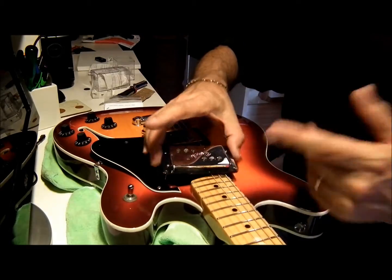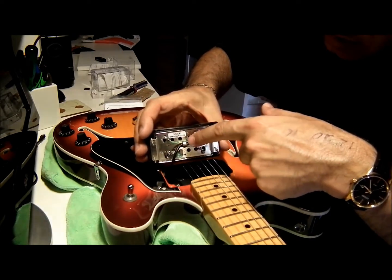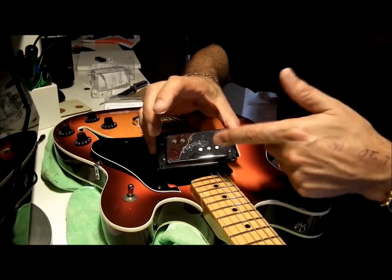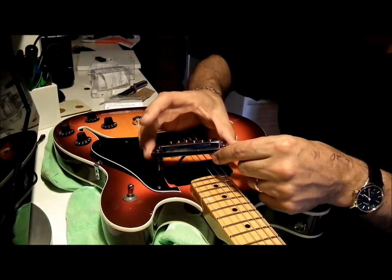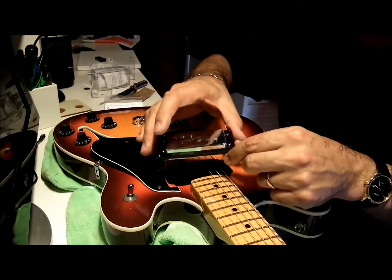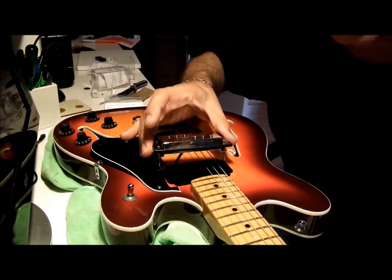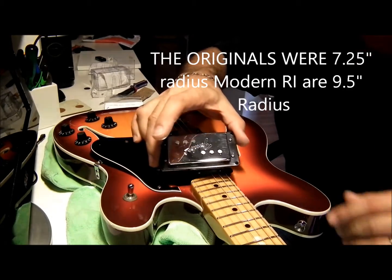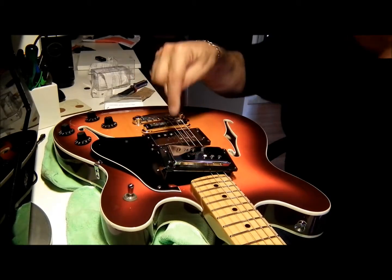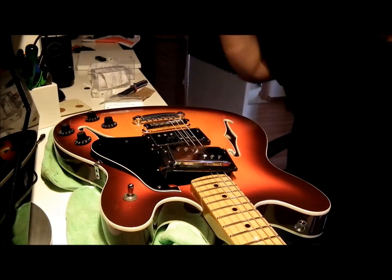So this is what you do to start with. I've done this one — I've just got to silicone the backs of them with a tiny little bit of silicone so that they don't move. Obviously they're not exactly like a Dynasonic because I can't adjust the poles, so I've adjusted them to where I think they're going to be fine. They look pretty good to me — just a really small radius. This Starcaster reissue is 9.5; the originals are 7.25. But I'm a rockabilly player and I don't like the nastiness of these humbuckers clean — they're a little bit thin and nasally sounding.